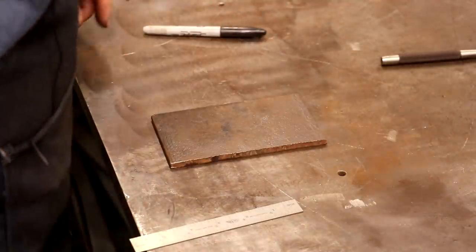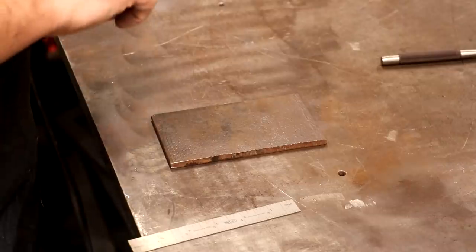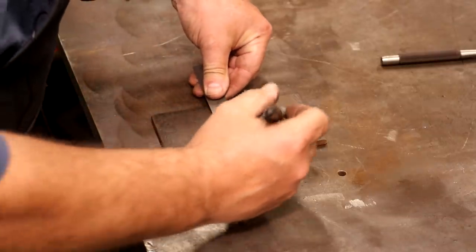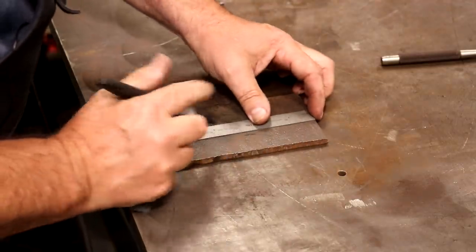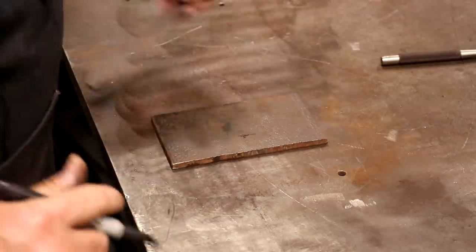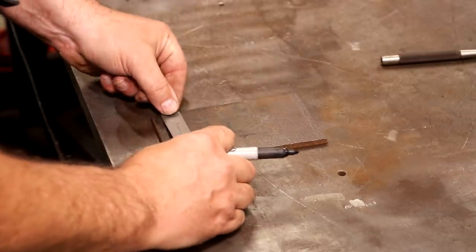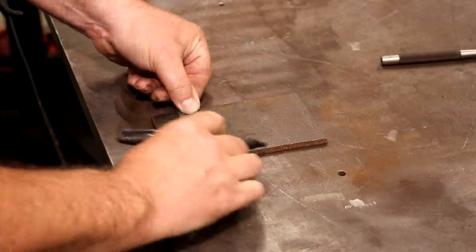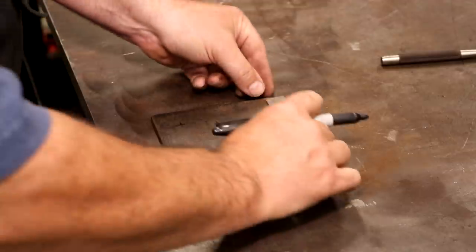This will be the plate that bolts down to the top, and I'm gonna have three holes in it to have bolts in. I want to go in an inch, and let's see, we want to do 3 inches, have it right in the center. So we got one right in the front center, and then I'm gonna have two more basically in an inch. 1 inch there.